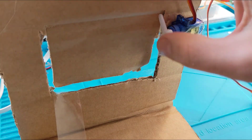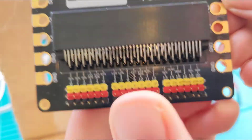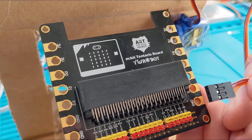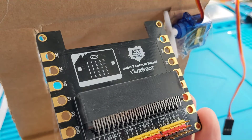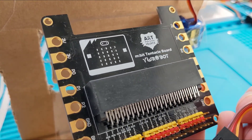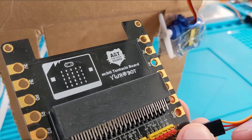Now with the tentacle breakout board, I'm going to look for pin 13 down at the bottom. Every servo has a plus and minus, just like a battery. They tend to be red and black wires — like a battery pack. This one has red for plus and brown instead of black, but close enough. The orange or yellow wire is for the signal — that's the data.